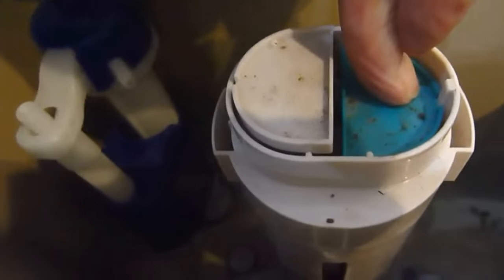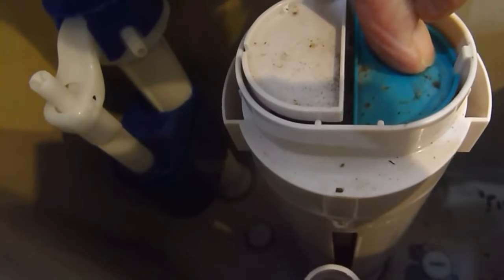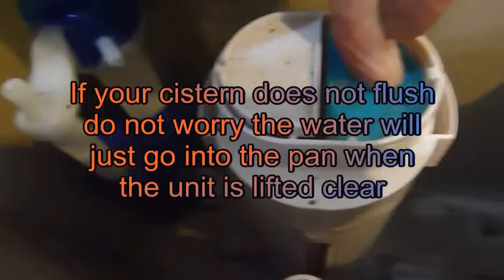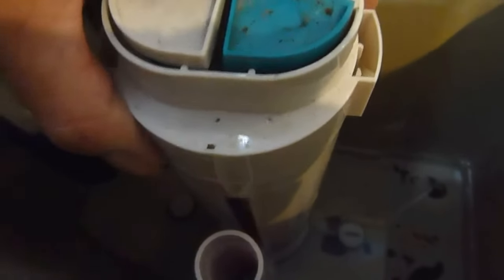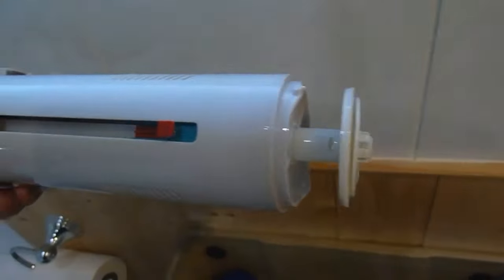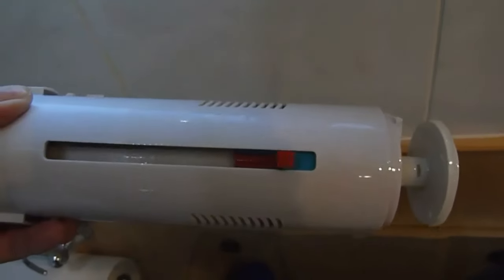I will show you now why we have to make sure that you get the right one. Turn the valve off there - she's off. Flush the system, flush her out, put the finger on the button and let it go right to the bottom. The reason why this particular system is different is because it doesn't have a pull switch down there - there are no levers to pull it off. What you have to do is just twist it, and once you get it in the right direction it lifts away.